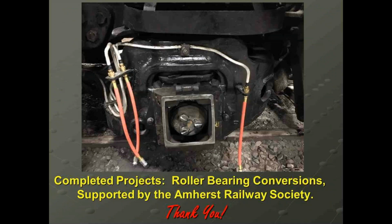I'll start with a completed project. This was the subject of the Heritage Grant that John mentioned a few years ago. When Pere Marquette 1225 was built in 1941, it was built with plain bearings or friction bearings, requiring journal oil to be added. Those have been outlawed for interchange. You can only operate with special permits for some number of years now. And so we've been replacing the friction bearings with roller bearings. The grant from the Amherst Society was to do the pony truck, the front truck on the locomotive. And here you see the completed work from your grant. That's an Amherst bearing there, a roller bearing.